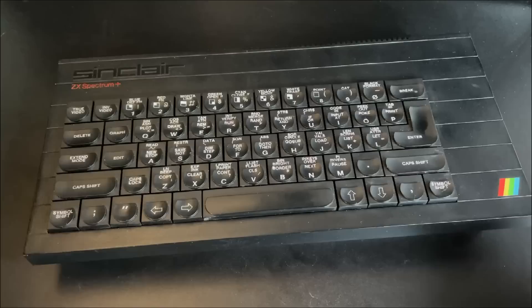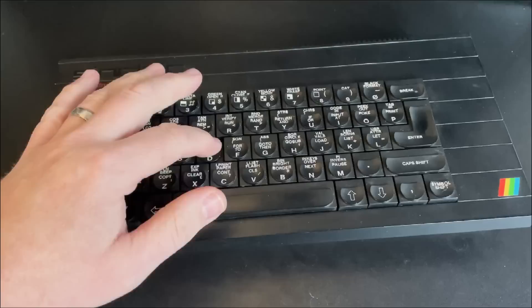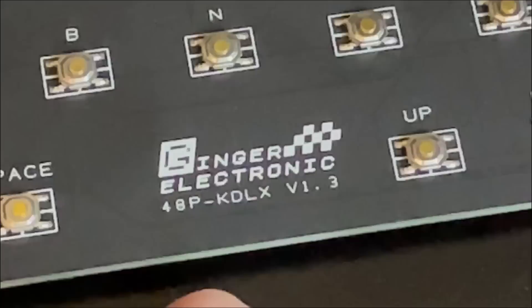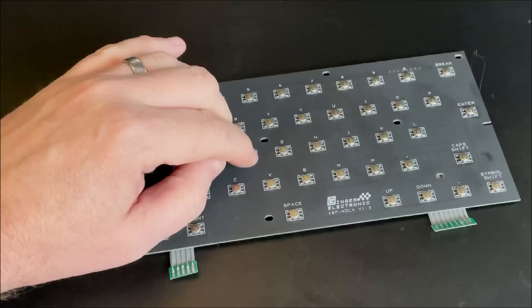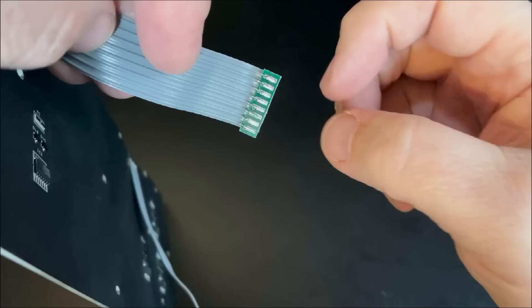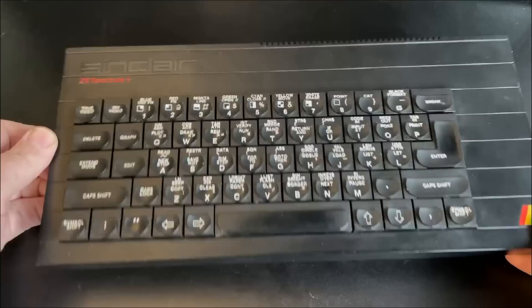Well, I was going to design a PCB to allow me to build a Cherry MX compatible keyboard, and I might still investigate that, but only if this doesn't do the trick. This is a combined keyboard matrix and backplate for a Sinclair ZX Spectrum Plus from a company called Ginger Electronics. Instead of the flimsy matrix, this replacement offers these little tactile switches, which promise a much more positive typing experience. It comes with these little washers and some mini PCBs to solder to the keyboard wires. The instructions say you don't need to do this and that you can just poke the wires into the Spectrum keyboard sockets, but you can solder these on — it takes two minutes. Right, let's open up the Speccy and pop this in.